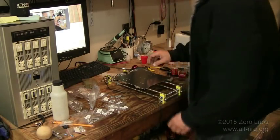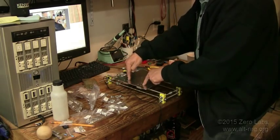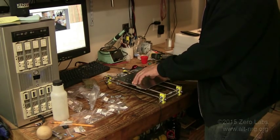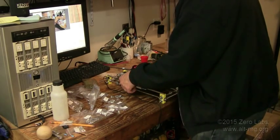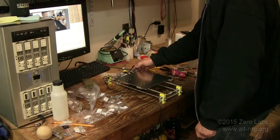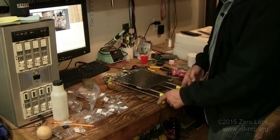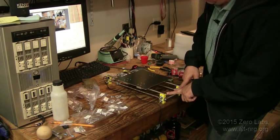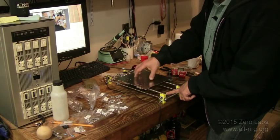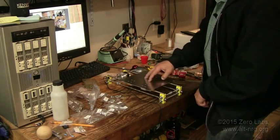Here's where we're at: this is the sliding plate that rides on the bearings. I have eight holes lined up with two bearings underneath, but these four holes with the bearing underneath aren't even close to lining up — they're almost half an inch off. I don't even know if I can get that much back by removing the lock washers and flat washers. What's going to end up happening is these threaded rods are really not long enough, and if I can't get these holes to line up, I'm going to have to redrill the holes in this base plate.